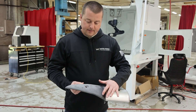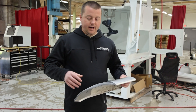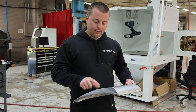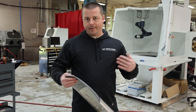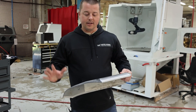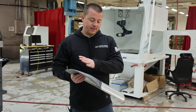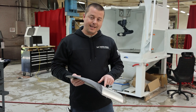You can see how impeccable the vapor honing process is when it's removing the coating without damaging the part. We were using aluminum oxide — I know you guys often have questions on what we're using. This was an aluminum oxide slurry that we blasted the part with at around 90 PSI. It only takes a couple minutes — this is not slow and painstaking. You cannot do this in a dry blast cabinet; you will pit and destroy the part. That's where the water from the vapor honing process cushions the abrasive.